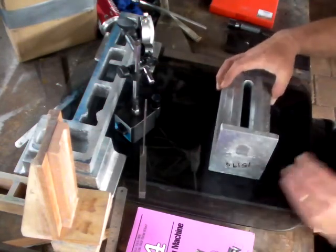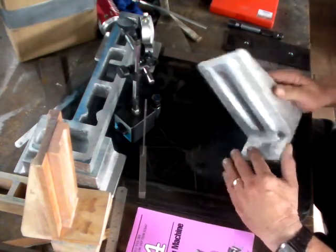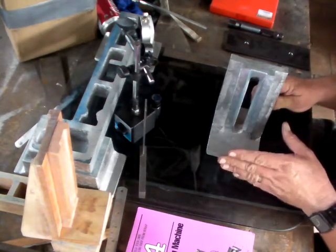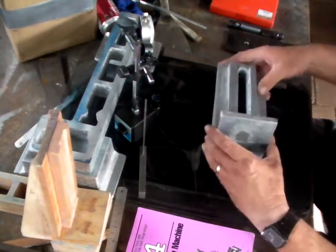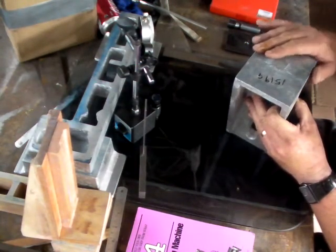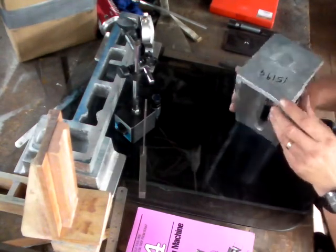I filed this surface and checked that the ways surface here was about 90 degrees to the plate. Remember, it's still a rough casting. So I presumed this first surface to be roughly about right, and with a lot of filing and hand scraping I got this surface down to be very smooth. There are some problems here with the casting, but nothing that's going to stop me from using it.